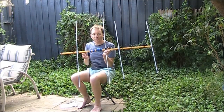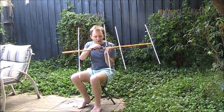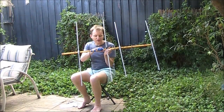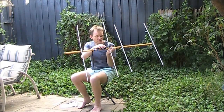One of the beauties of the W5TX antennas is the direct feed from 50 ohm coax cable. Here I've got a balun — it looks like about five or six turns of RG58, which is the feed line itself, wound over a pipe about 30 millimetres or so in diameter, just protected with insulating tape.